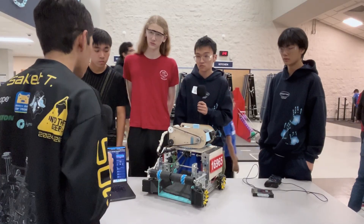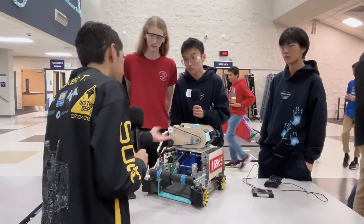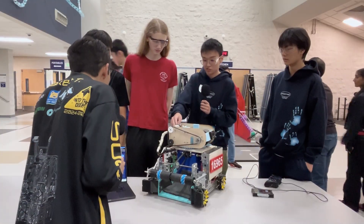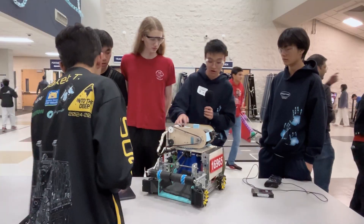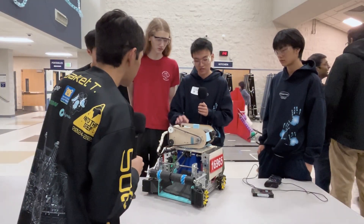Can you quickly go over the turret hardware — what bearing and motor ratio you're running? We have a 4-to-1 gear ratio with a 3-to-1 motor on our turret, along with the lazy Susan bearing from Amazon.